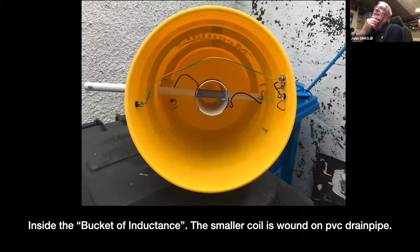You can see a couple of the connections there. You can see the green and white wire, that's just an earth connection between the antenna coming in at one side and the connection across to where the radios connect at the other. There's two wires inside connecting the two outer coils through what's actually a double coil. You'll see in another photograph in a moment how the inner coil is constructed. It's actually one coil, but there's a space in the middle to allow the axle to go through. So flexible copper wire is used just for the connections across. I put tag connectors on just to make it easy to connect. If I was doing it again, I would probably spend a wee bit more time with the internal connections and so on.